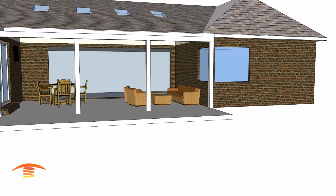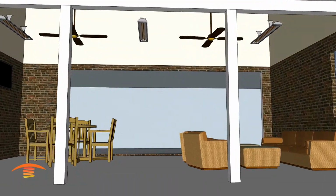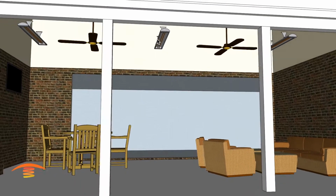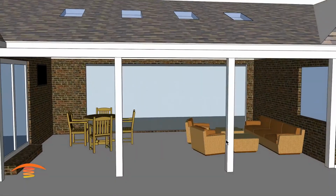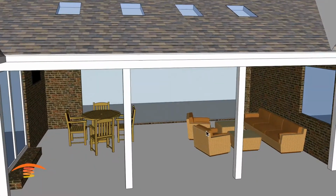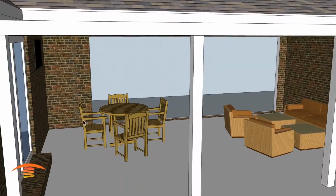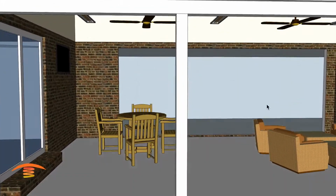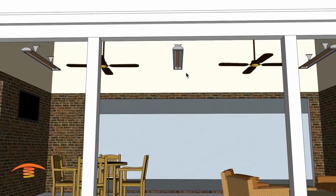And this would be the option that I would prefer to see, is taking three 6,000 watts. And when I say that I prefer, I'm talking about heating up the whole entire area as much as possible and getting nice heating on both sides of this seating position here as well as over here. So this option is three of the 6,000 watt units.